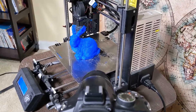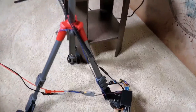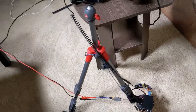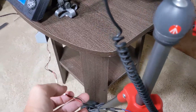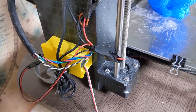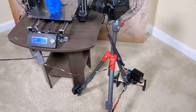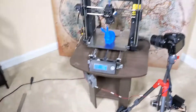In case you're wondering how this footage was taken, I'm gonna zoom out here and you can see that the camera is mounted on a tripod that has a little driver wheel with a stepper motor behind it. We have communication between the camera through this cable and the printer. The printer sends a trigger signal — that's already done for regular time lapses — but now it also sends a trigger to the cart so it moves the whole camera around.